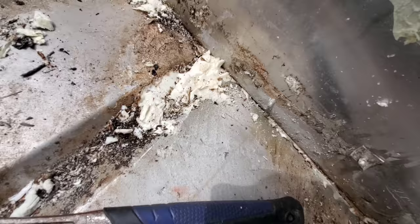What I will tell you though is a big pointer. I'm gonna roll this carpet out and I'm gonna put all the parts on the piece of carpet the way they're gonna face in the boat, and then I'm gonna cut everything directionally the exact same way. Big mistake people make is they don't pay attention to the parts and they cut random shapes every which direction out of their carpet and assume because the carpet's the same color that when they put it in their boat, it's just going to be the same color.